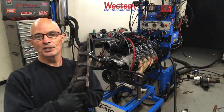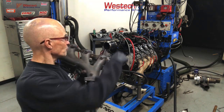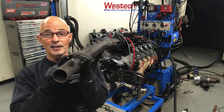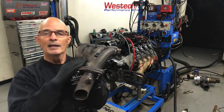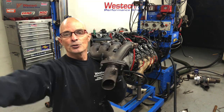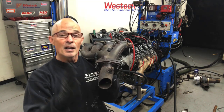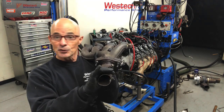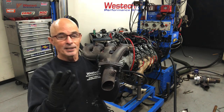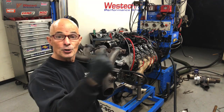The start of any good turbo setup, whether it's a single or a twin, actually comes from the wrecking yard. First of all, it is the stock exhaust manifolds, but the important part when you're getting the motor from the wrecking yard is this section of tubing that always comes with it. In our wrecking yards they have a big snipper - they come in and pinch the catalytic converter and drop the rest of the exhaust off. So they end up cutting it off, and that leaves you with a section of tubing which is two and a half inch - fine for a twin turbo setup - and it leaves you with the flange that's already drilled and ready to bolt right onto the stock exhaust manifolds. We're going to remove some of these flanges and start our new twin turbo kit.